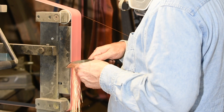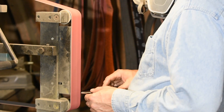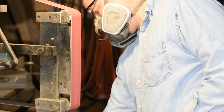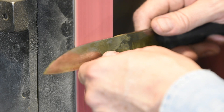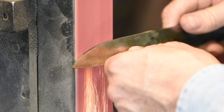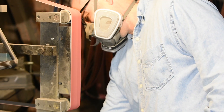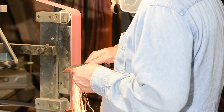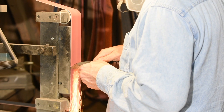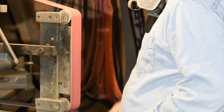Check out their online shop by clicking the link in the description. Here's a really important point that bears on grinding Scandis and chisel grinds. When I'm contacting the blade to the platen, I never ever contact the spine side first. I just kiss the edge, holding the blade very gently, then feather it in until I'm sensing that the blade is flat to the platen. This takes some practice and sensitivity, but you can get it pretty quickly once you realize that you don't need to just slam the blade in there and hope you get the right angle. Feel it.